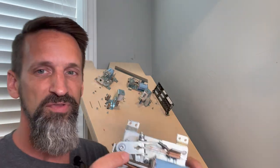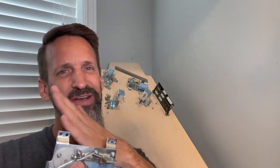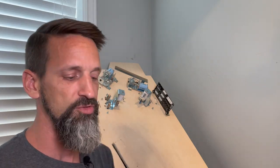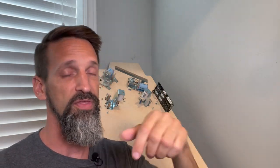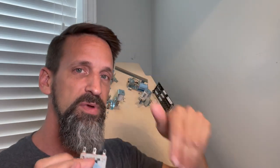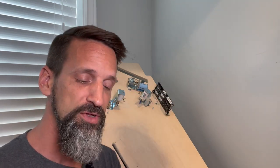That's because when the flipper is flipping, immediately the first time you want to flip really hard and twist that flipper up. But once it's up, if you're holding the button in, it doesn't need much power just to stay up and kind of catch the ball and hold it there. And we don't want to burn out the coil and use way too much power. So they got really nifty and really smart back in the day. They decided to do 2 windings, one with the main power and another one with a smaller power, we'll call that the hold power. We'll have a lug for each one of those. Then we can use different hardware, different ways to switch it over to the lower power to hold it, okay?